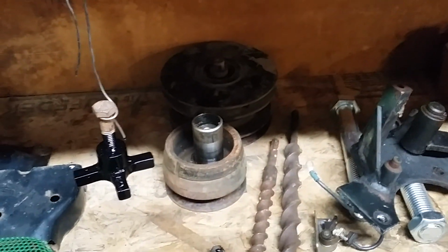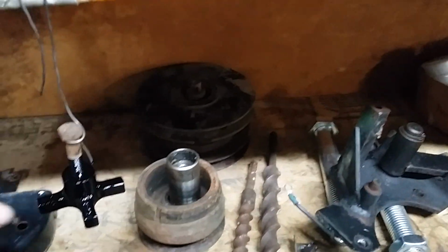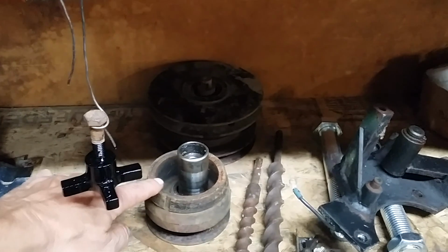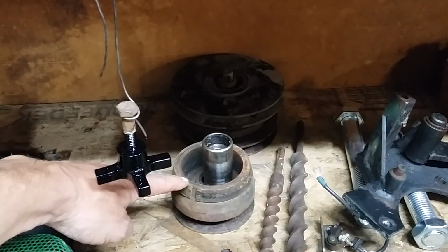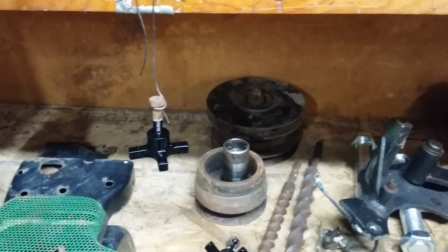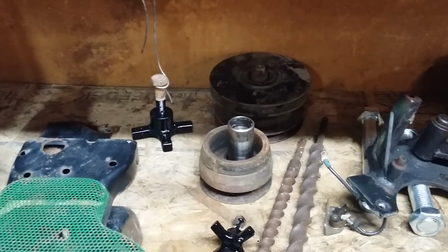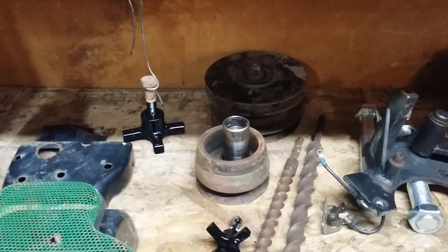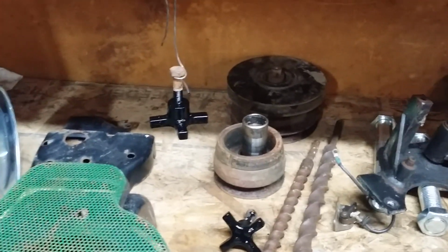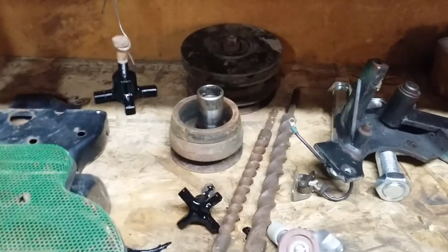And even better yet, it still had its PTO clutch on it, and it looked like it was barely used. It's reversed from what my 200 series pulleys or PTO drives are, but it looks like it should be usable. I just have to take the entire clutch assembly off my 200 series and put on the entire version of this. So not too worried about that. That'll be a nice addition considering one of my PTOs is just about smoked.